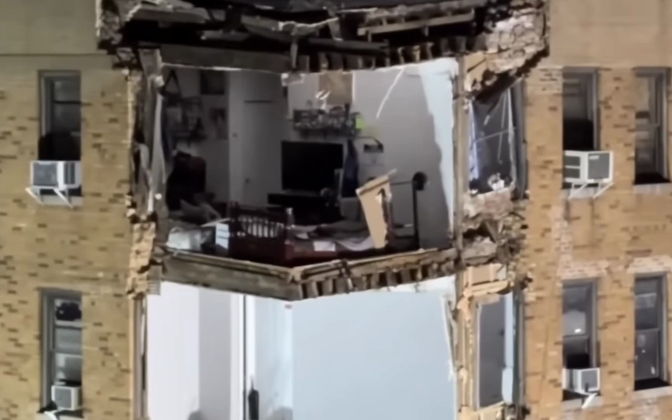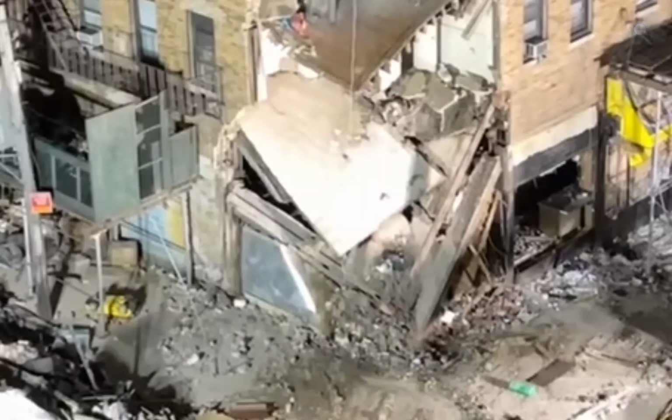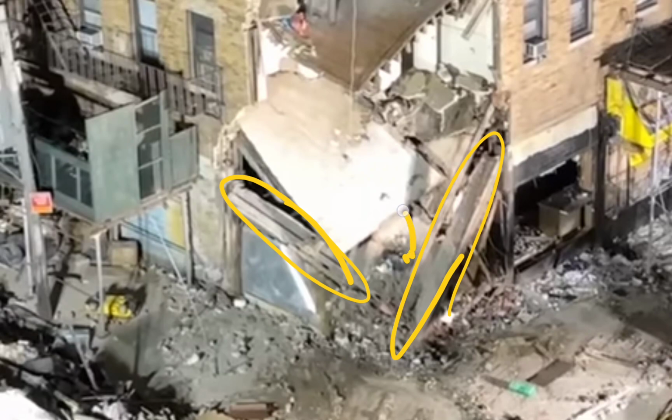It's as though part of this wall buckled also, not just fell over. It's six stories tall, so once you think about that, it didn't just go boom and pivot from here. Now, it consolidated from the bottom up, and this would look like that. Still the same result. Top down, bottom up, still the same result. It's not a hinge point here, and boom. No. So I'm thinking this is steel. All right, steel. And I'd like to see if back here the column bowed back. Did it have steel in it? Did it take a rotation backwards?